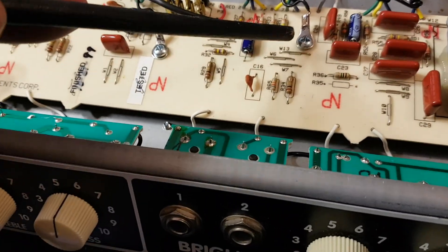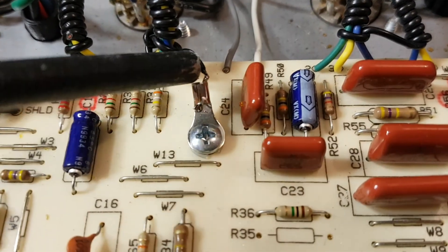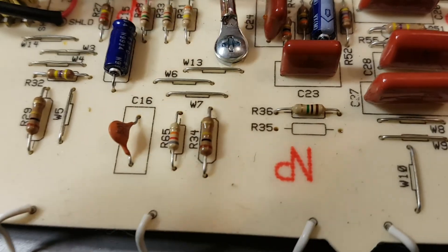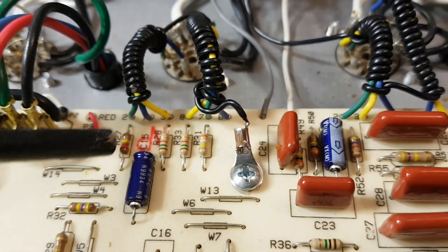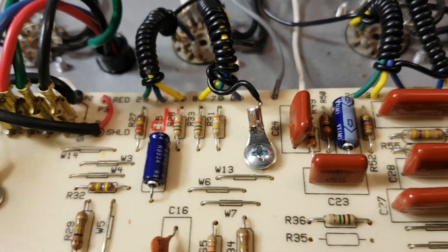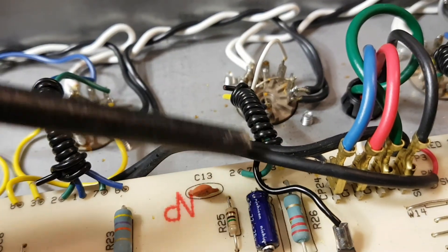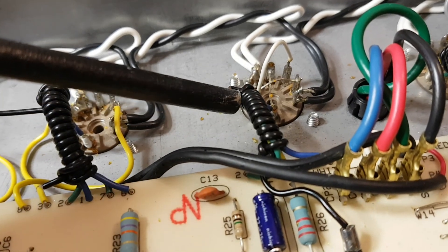This is a quick and simple solution. Basically, what you're going to have to do is get yourself some lugs like that. I did this step last — I first just anchored the wire at some place and did the wrapping all the way around. One wire for two stages of each tube. There's one exception, and that's this guy over here where both stages are together — this is part of the reverb circuit.